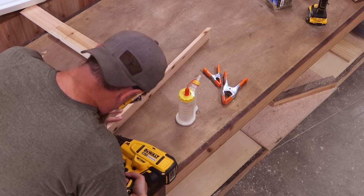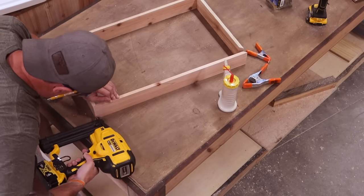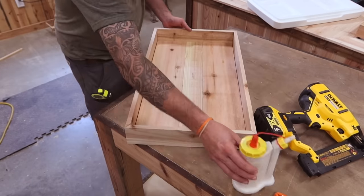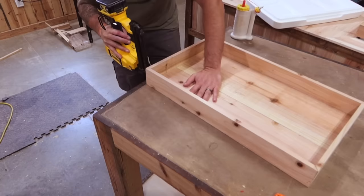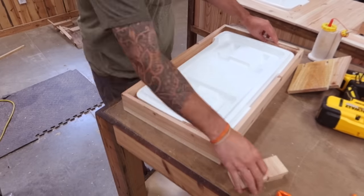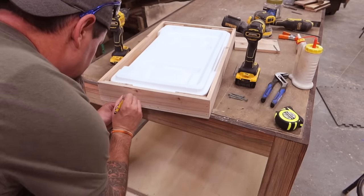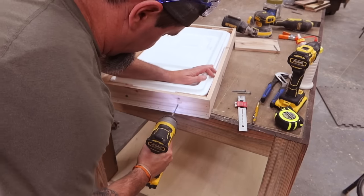So for the wooden lids, you'll need parts O and N — we're going to put these on 45 degrees. You could use a butt joint for this, but it's just adding more to it. The more detail that you can add, it will set your item apart from anyone else's. So for now we're just using some wood glue and nails. Now the top inserts are going to be three boards labeled P. We are actually going to custom fit the center board. So with the top inset, I'm just gluing all around the edges, and then I will be adding some more finished nails. And to help ensure that this lid stays in place, I'm adding half inch spacers all the way around. And to attach our cooler lid to our decorative lid, I want to measure one and a half inches up by four inches in, and then install a two and a half inch screw. I'll be putting two screws in each end.